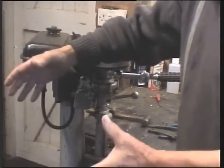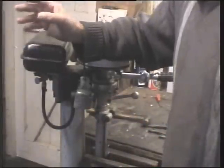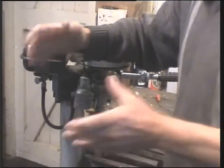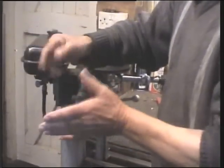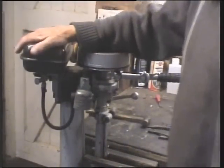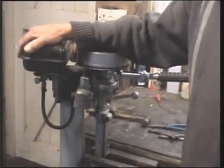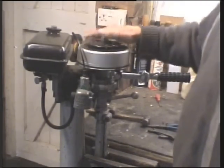The propellers are very large, and they move a large quantity of water at relatively low velocity. Whereas modern design outboards use a much smaller propeller, greater pitch, far more thrust, but lesser volume. These are designed for displacement craft - a craft that goes through the water and not over it. So they never rev high, they never go fast, and they are what they are.